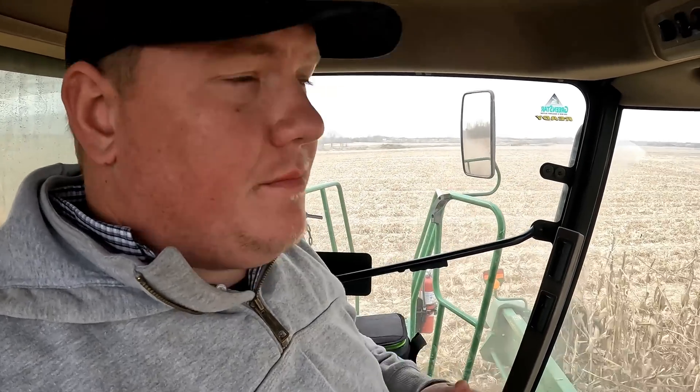Running TerraStar X in soybeans helped and worked as expected, but I was more curious about how I would use it to harvest corn. Running TerraStar X in corn — it works, with the caveat that you have to plant with a sub-inch accuracy correction source, either RTK or TerraStar X. Since a TerraStar X subscription is year-long, if you buy it in the spring you should plant with it and then be able to harvest with it, as long as the system is compatible — say, using Ag Leader across the entire platform. It holds the rows really, really well. I can see this being a real benefit in gooseneck corn or where corn is lodged or laying down.